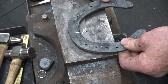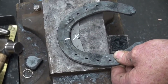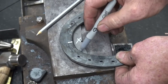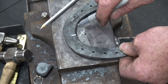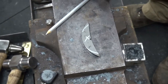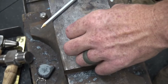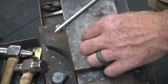I like to have a little bit of an air gap down on the front, right through here — that's just for the weld to go into. So I mark it, and you can see the pieces I need to grind or cut off. Since it's on such an arc, these bandsaws with a wider blade make it harder to cut into that arc, so I just grind it into that shape.